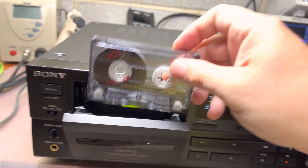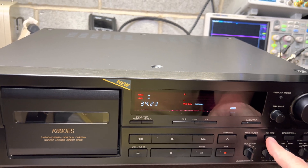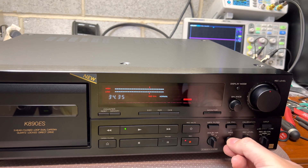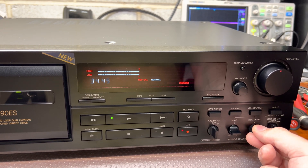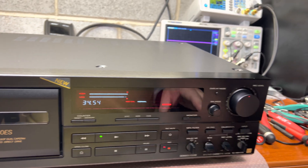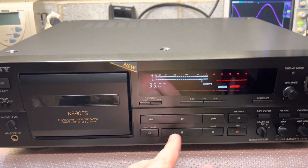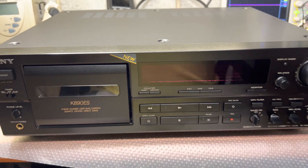Let's try Type 1 tape and see if we can calibrate it. Calibration mode — HX Pro, recording, start. Let's do bias first. You see how significantly we had to reduce the bias for Type 1 tape. Definitely, definitely — 10dB, it's 10 times lower than needed. I would expect with this Nakamichi tape like minus 2dB at 15kHz, but not minus 10 — maybe minus 3. I will work on this deck tomorrow. Today I'm just checking up. Thank you for your time, and see you in the next part. Bye-bye.